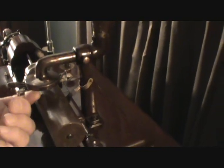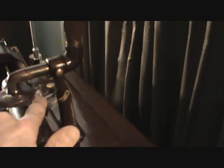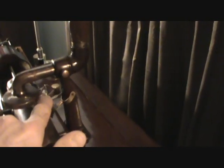The difference between the Edison Music Master horn and the Edison Signet horn is that the Music Master horn is attached to the back end of the reproducer carriage in such a way that it adds no extra weight to the reproducer as it's tracking the record. The record is only tracked by the weight of the tail weight that the stylus is attached to, so there isn't much wear on the records.